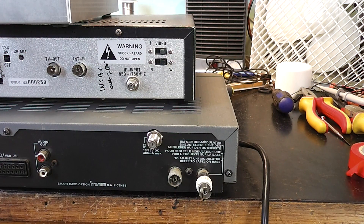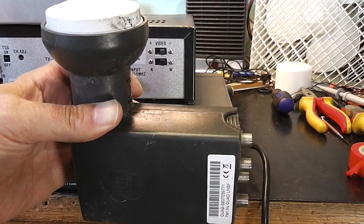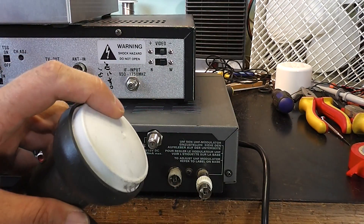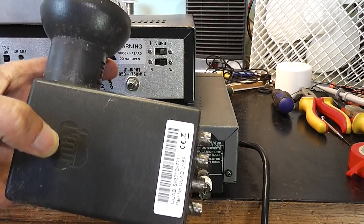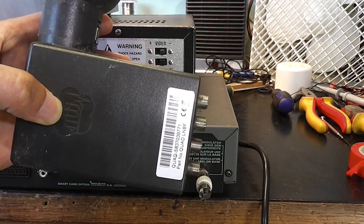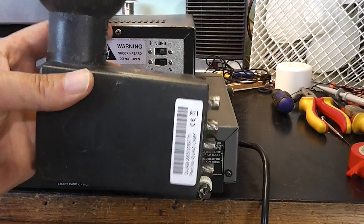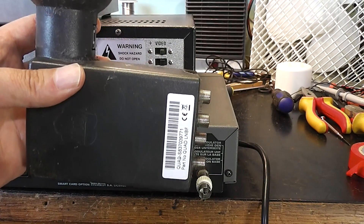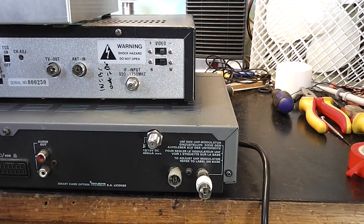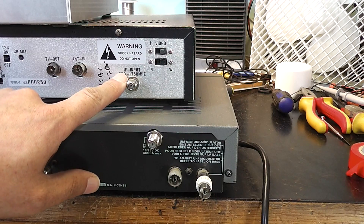Now I just want to talk a little bit about satellite receivers and their gain. A satellite receiver is designed to be worked with a low noise block — this device here on the dish. It contains a microwave aerial and also a local oscillator to mix the high frequency — typically 10 to 11 gigahertz — down into an IF range, which is generally around 950 megahertz to about 2 gigahertz. This one actually says IF input — Intermediate Frequency Input.